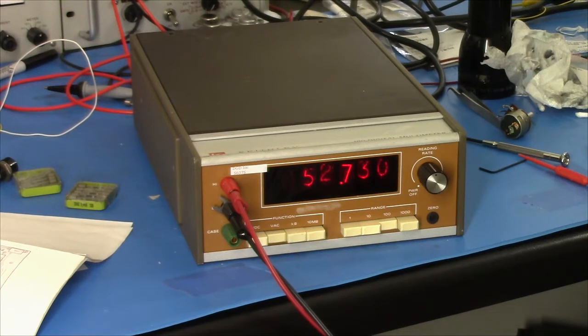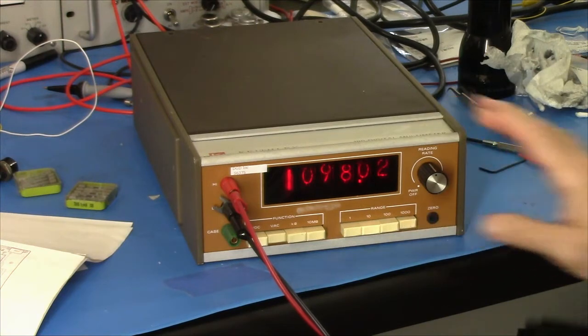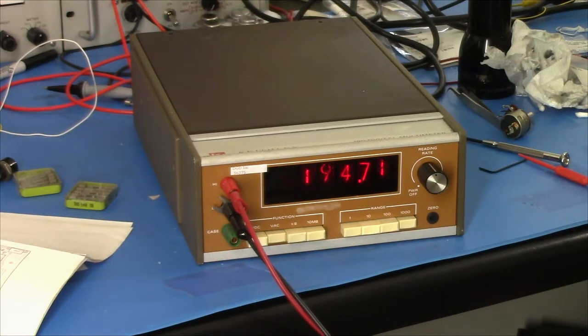Operate. Okay, 176 counts. That's still within 360 counts. 175. On the 1000 volt, I cannot go to anything over 110 volts with this. It's set to 110. So on the 1000 volt scale, it's putting 110 in, and you can see, well, that's way off. It wants me to put it at 400, and I just can't give it 400.